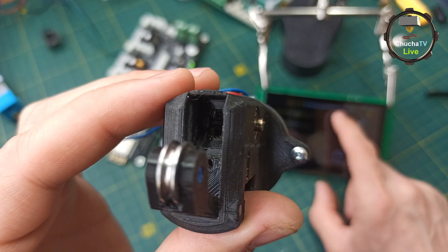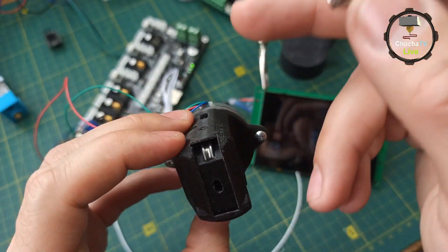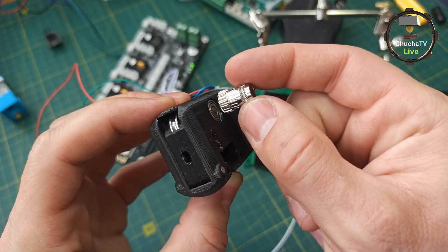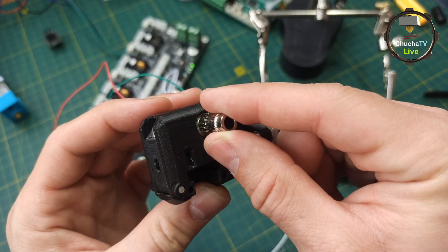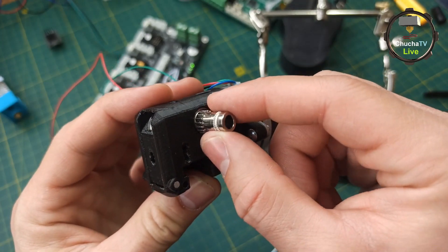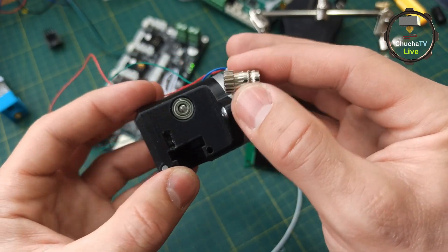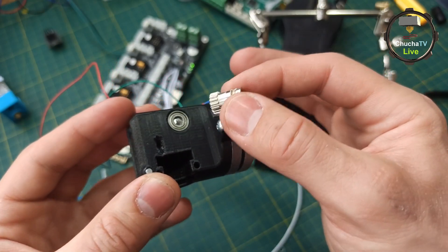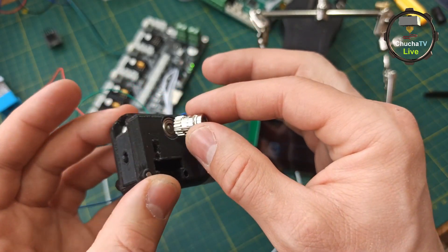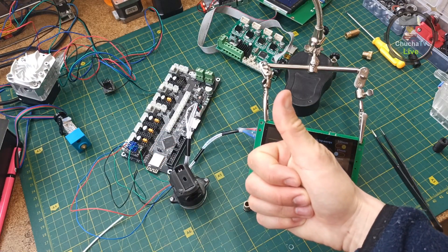Unfortunately it won't feed filament right now, as I mentioned, because the plastic simply won't push against itself properly. But the best solution will be to completely separate the worm gear drive — move the pressing lever to the side so it works with a dual-drive gear setup. That way we'll have no problems with the worm, its lubrication, or the filament feeding, since dual drive grips filament much better. This project will be fully viable. As you can see guys, everything is achievable here — no problems. I'll try to finish this device in the coming days so we can test and try it in operation. I hope you enjoyed this video — don't forget to subscribe to the channel. See you next time!